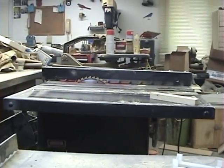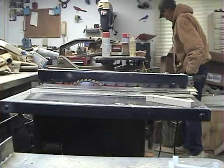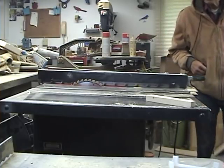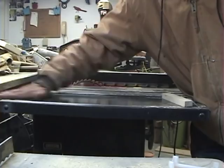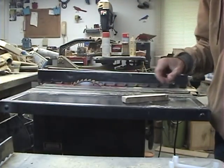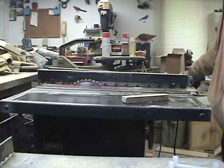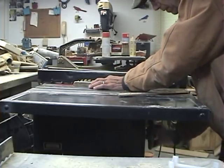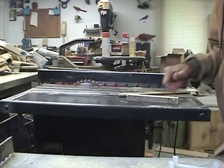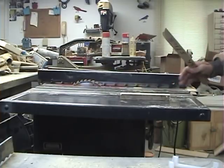Kind of go over here and get the saw set up. We'll rip a few. Now, anytime you're using power equipment, you need to be safe. Power tools respect nobody, and they'll cut your fingers off, put your eyes out. I've got my glasses on. I've got my push sticks. When you're cutting boards, don't leave your blade stick out too much past the thickness of your board. Just a good tip like that. This is not a safety video, but you got to use your own head.